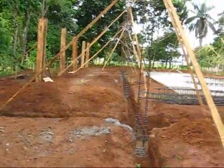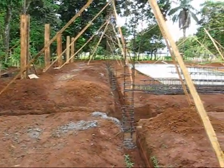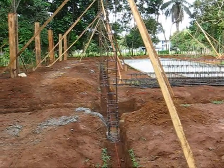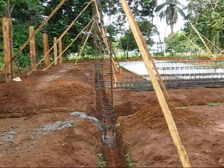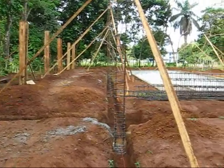That would be the height of the beams, and then the roof will be above that. Because we have earthquakes here, there'll be seismic beams — concrete beams with rebar that connect through these trenches. They connect all the columns together at the bottom, and then there's steel I-beams at the top connecting them, which protects us from earthquakes somehow.